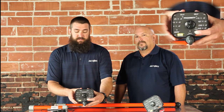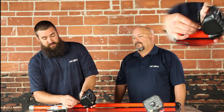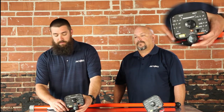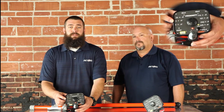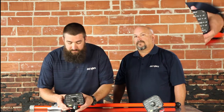As it comes on, it's doing its own internal self-test of all the lights and the horn. When that concludes, I'm just going to plug the jack right into the socket in front of the unit. We should see a reading when I move the output clip of the tester-tester to the input sensor of the unit itself. And what we have is both the 4 and 15 kV lights, so we're within tolerance and we know that this unit is reading properly and ready to be used.